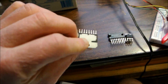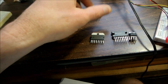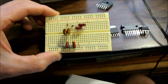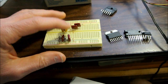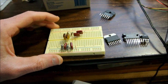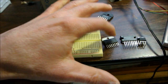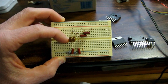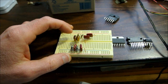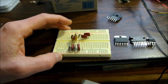Very simple chip to use. I'm going to lay it out on the breadboard here and hook it up. Here's the circuit — not really much at all. There are no feedback capacitors because on this chip it's handled inside. It's just film capacitors for the input, power supply decoupling, and the Zobel output network.